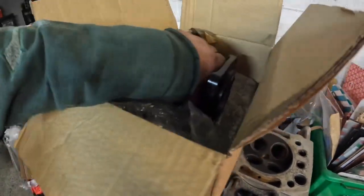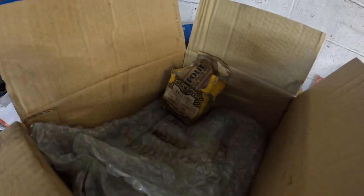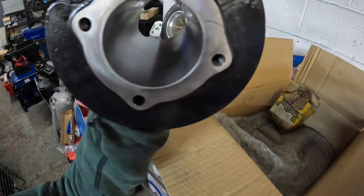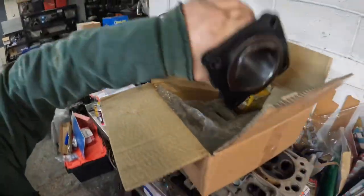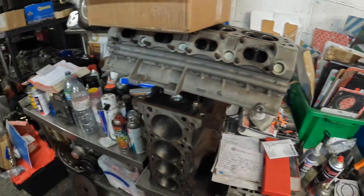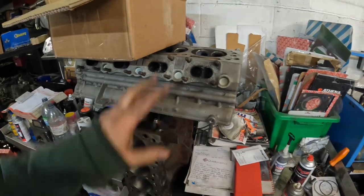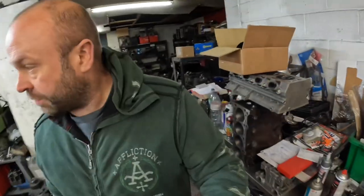I'll quickly run through some of the jobs we've recorded but lost. One of them is this BSA barrel which I've rebored — the guy supplied a new old-stock piston and I've honed it to suit, then took his studs out, so that's ready to go back to him. I've also had a Cosworth cylinder head in which I'm going to do a completely separate video on — it's coming in for full reconditioning, new valve guides, and bits and bobs like that.